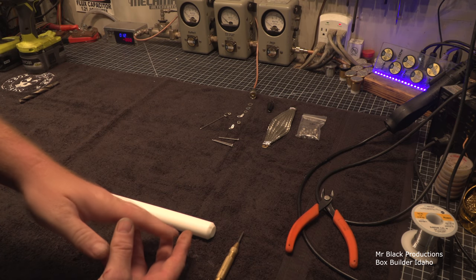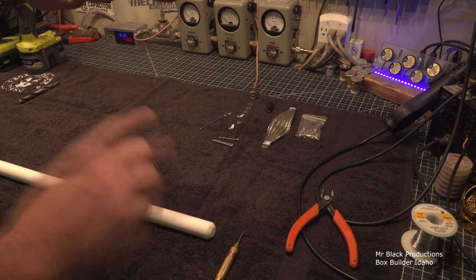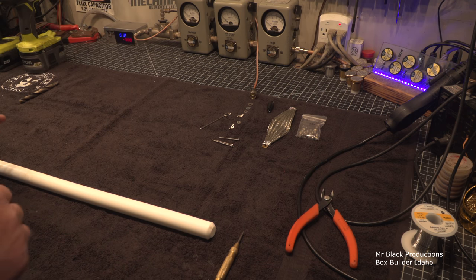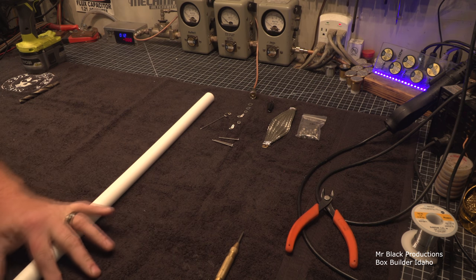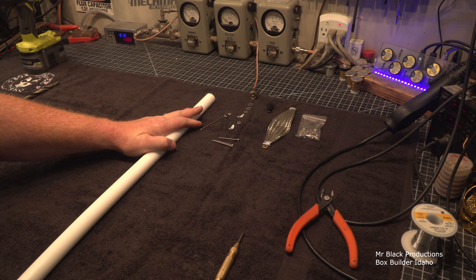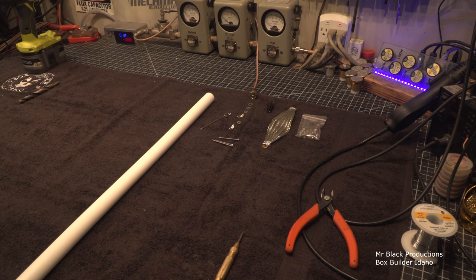multiple insulator bells together on a string, suspend them from a metal arm, and the surface area of each one of those insulators is what allows people to have the heavy weight of the wire and then clip onto that, and the high voltage does not leak across the top of those insulators and up to ground. Or come down to ground, or let itself find potential to ground. The surface area, that's how an insulator works.